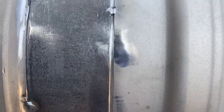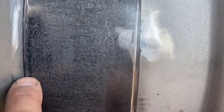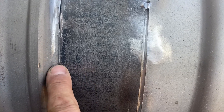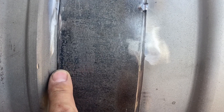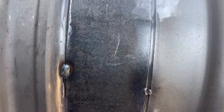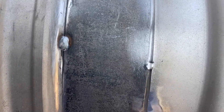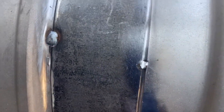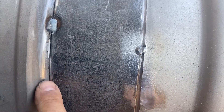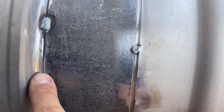In the initial build I just butted the band to the rim and it's really flush and tight — it looks really good. But to get good weld penetration, I did some practicing on an extra wheel I had and it was just stacking up on top. I wasn't super confident in the penetration; I think it would have worked satisfactorily, but I wanted it to really look good.